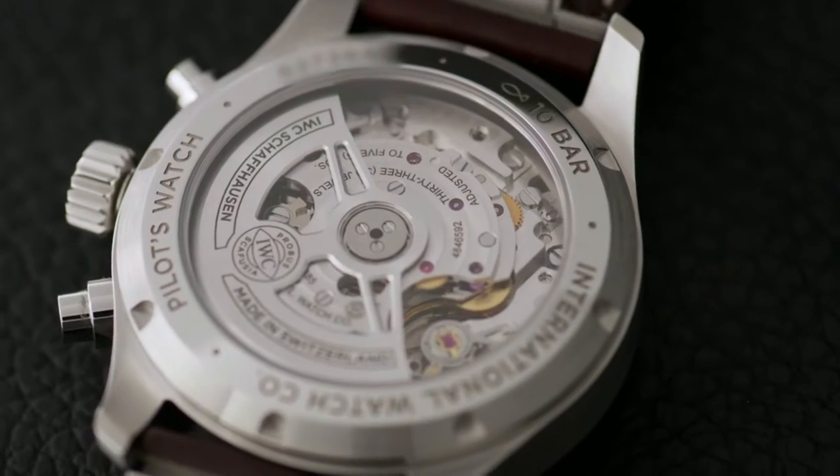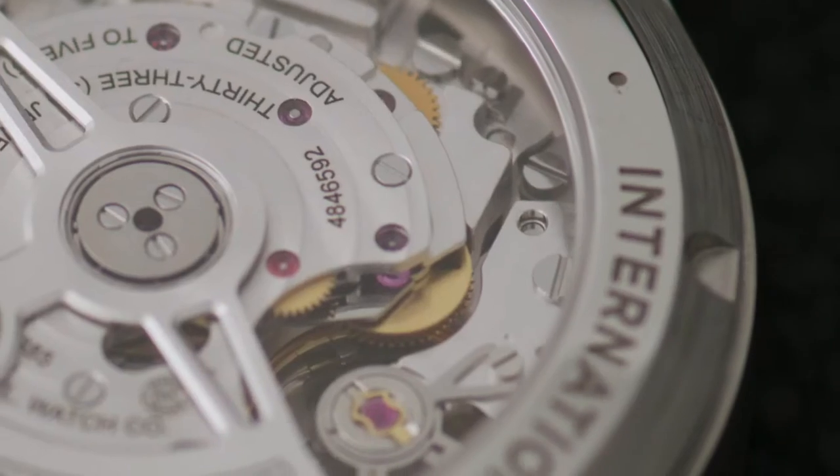What does the process look like for you as a watchmaker to work on those three chronographs? The biggest challenge is that the chronograph is a separate gear train which interacts with your normal powertrain. This interaction always costs extra power, and as a watchmaker you have to constantly adjust the settings to keep this loss of power at a minimum.